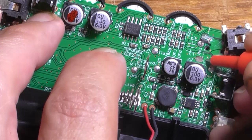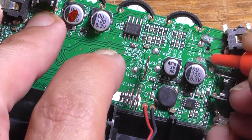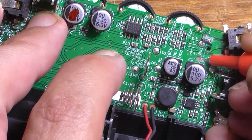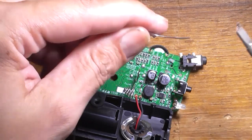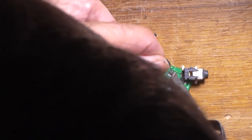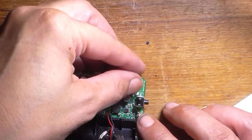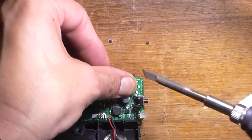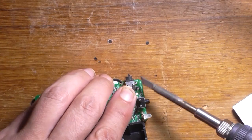I'm using a multimeter probe because it's the handiest thing at the moment. I just need to get rid of some of the green protection coating. This soldering iron tip is way too big for the job, but I'm going with what I've got. Getting it to take to the copper is going to be the challenge. It may not be scraped enough — but OK, I've got the blobs to take. Here comes the fun part — trying to see if I can get it to solder to those blobs. That was hot. Very hot.